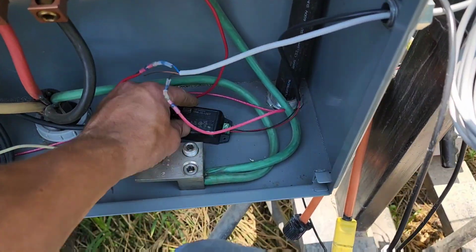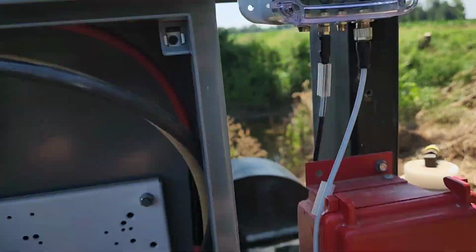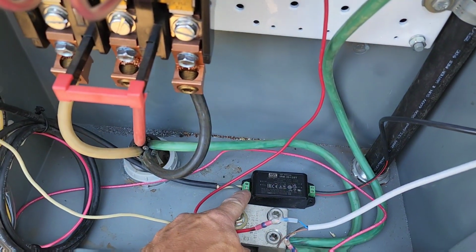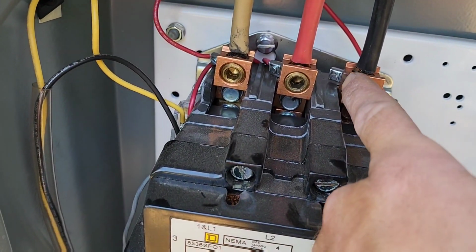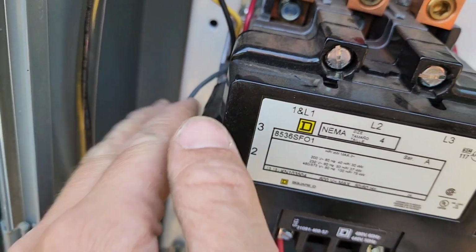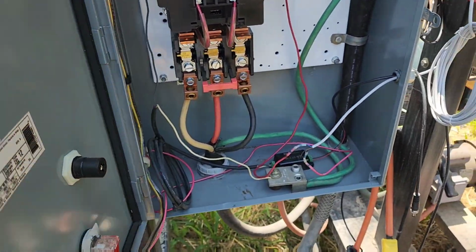Okay, so here is my 12-volt power supply. We've connected the red and black wires that are this cable that go into this box that I cut off from that battery into there. We've got wires, line and neutral. We came up to here. I was gonna go off of this screw there, but I don't have the right screwdriver to get to it, and I did that one, and that's got 277 to it all the time. So we are good there. Ground, everything should be good. We can close this up, fire it back up.